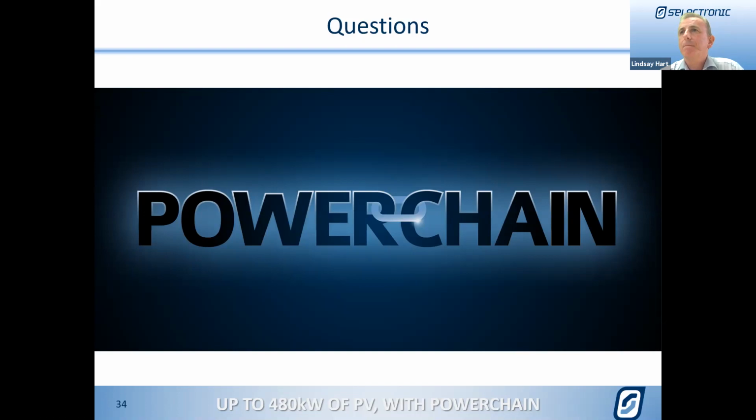Yep. And so Don Anderson from the West has come in with the Fronius Primos. Yes, they have always been the slowest to respond to our commands, and it's just through their internal system. There's no particular problem with those units. So when you have 5 of them, there's a sneaky way where we can actually get the data from all 5 much faster. They have a parameter which they internally collate, which is the total system power. So whilst it's slow to get that across from all of the individuals, the total system power, when we've got 5, comes across at a reasonable rate. So there's no problem with 5 on that system.